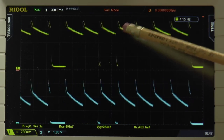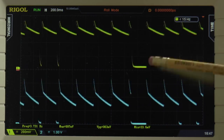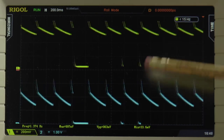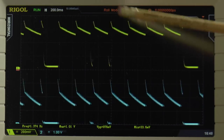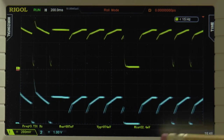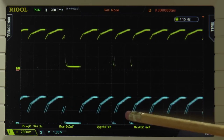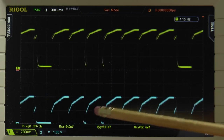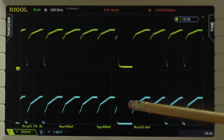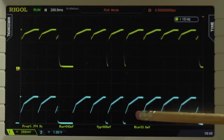You'll notice that the waveform is still not so drastically modified from the original, aside from the drops and rises to zero. But the sharp peaks up there, and if we look, for example, at the slow attacking waveform, the slow attacking waveform has some errors in it, by the way. I don't know if you can see these on the oscilloscope, but there are little sharp peaks, little tiny ones that cause clicks and pops where the voltage is first coming up from zero.